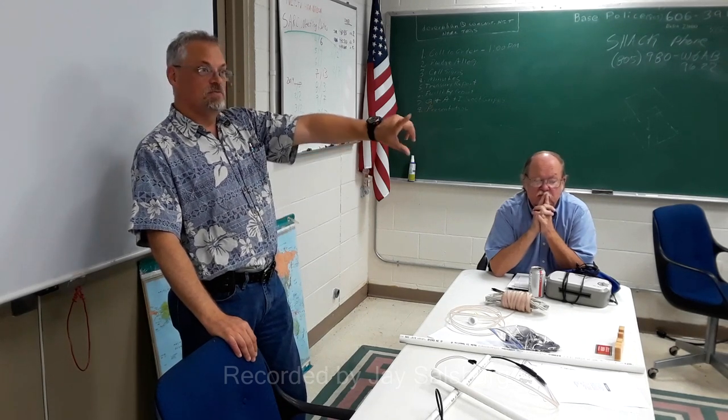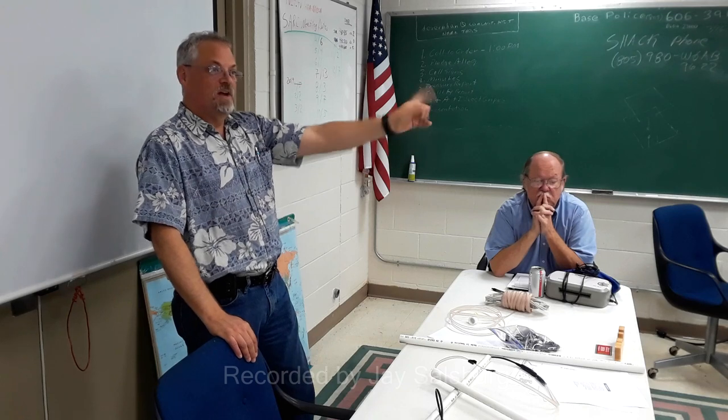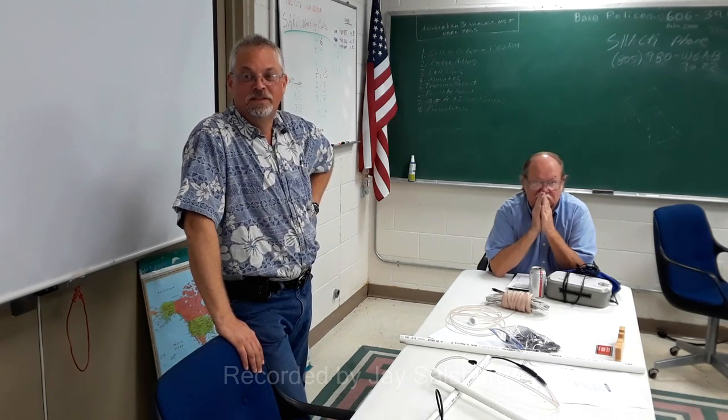You know, when I first got into ham radio, I didn't understand that principle. And I always had a field strength meter sitting on top of my rig, and it would bounce around when I'd operate. And I thought that was normal. No. You shouldn't have RF coming back up your shack. If there's another transmitter, or if there's energy not being produced by the antenna, it will impact onto the outer conductor, and that voltage will be seen on the output of your transmitter.